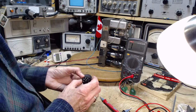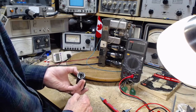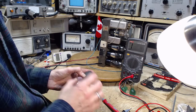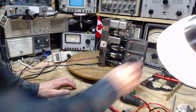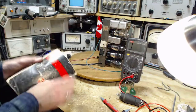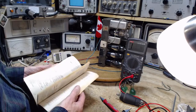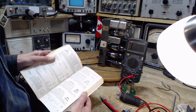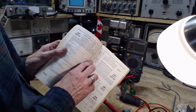That's pin number... Ooh, okay. Looking at the tube from underneath, that's pin number 1. That typically is a ground pin on a lot of tubes. Now, on the 6Q7, a regular, everyday run-of-the-mill, go down to the store and buy it, 6Q7, pin number 1 is just open. Ain't nothing going on there.